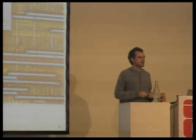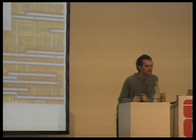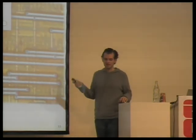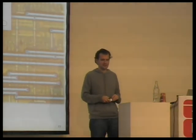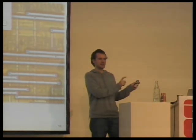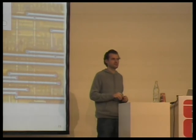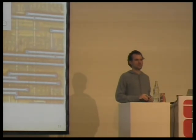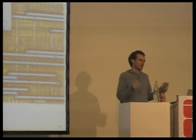Okay, the question in the back? Yeah, I think there's a high degree of automation in your functionality, at least in terms of PCB acquisition, maybe with some sort of CNC scanning. So the question is, have we automated any part of the acquisition of the images? And sure, taking the images doesn't take all that long. All the different images, with a stage that automatically moves, which we are already using sometimes, takes maybe 5 minutes. So the polishing will be your bottleneck, getting just right to the layer where you want to be. And I'm not sure how much you can automate that. If you could maybe build a robot that puts it in HF for 30 seconds and then takes images and then does that. Yeah, we haven't automated that yet, no.